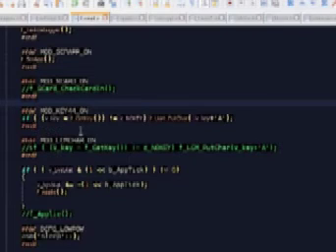Now in order to make the motion smoother we need the application to run outside of that timed loop, in order to provide the commands from the keyboard to the RC servo more smoothly. In a real automated application this might not be the case, but for this example I believe it's a good thing to do, and you can see the full capabilities of this design.